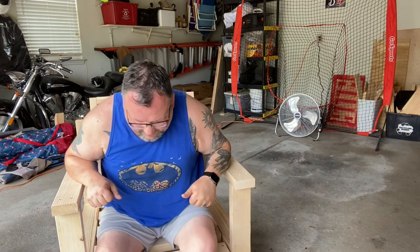They were comfortable enough, but definitely when you do this chair, if you do this chair, we will give you dimensions. You're looking at like a 9 degree tilt angled backwards. So it's less comfortable without the cushions, but still very doable.